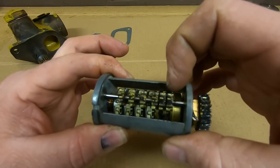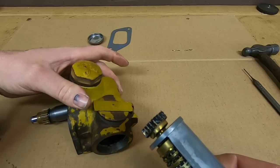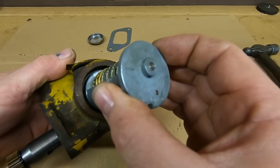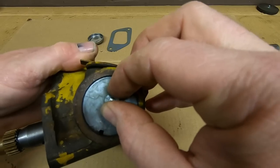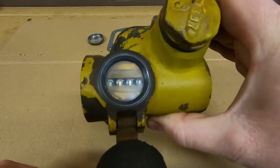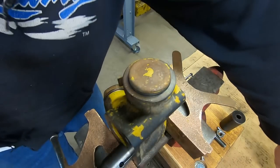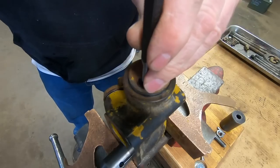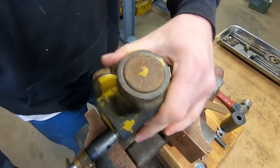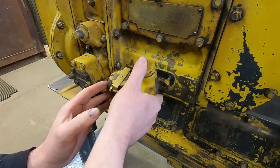Plenty of good assembly lube around the drive gear and all of the teeth on all the dials and pinions, especially these ones towards the front that are going to do the majority of the turning. Now we can put the whole counter inside the housing — pay attention to this notch at the bottom that aligns with the peg. Quick look inside — I think we did it right. Now we can seal it up, put the end cap back on, drive it down just until it contacts the counter — that's what keeps it seated. Gasket in place; it's just a matter of bolting it to the injection pump now and we'll have another one in the books.